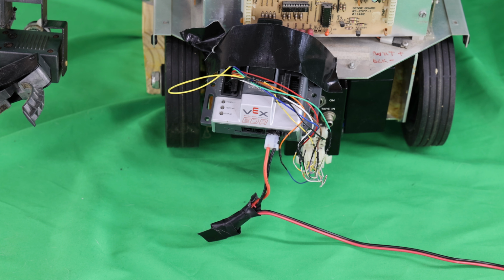I mean, when I was micro-stepping the rotation of the wrist and the gripper, I thought at first that the thing was just dead, but I had accidentally set the settings for 1/32 of a step instead of 1 step, but then I saw it slowly turning.